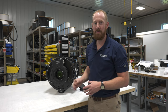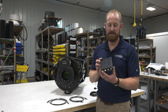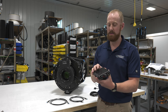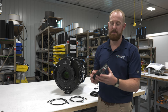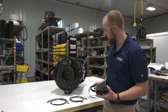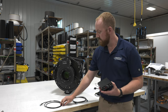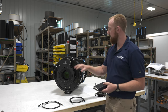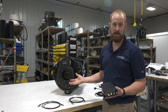With the Series 5 focuser and rotator installed on the Delta Rho telescope, let's discuss the Series 5 controller. The Series 5 controller is powered by 24 volts — not the standard 12 volts that some of our accessories run at — and it's clearly marked 24 volts on the front face plate. You have a power switch and a USB control switch. The controller is included with a USB cable and two control cables if you ordered both the focuser and rotator. These cables run from the PW bus out on the controller to the PW bus in on the accessories — male and female, pretty straightforward.